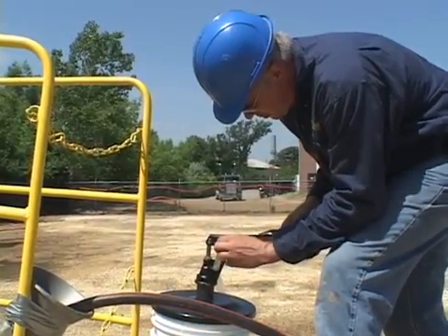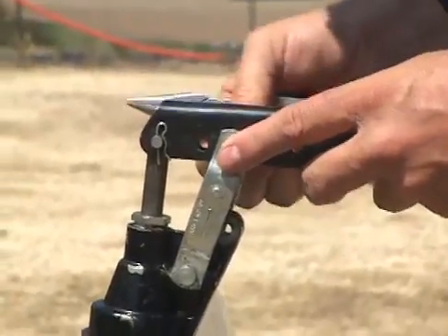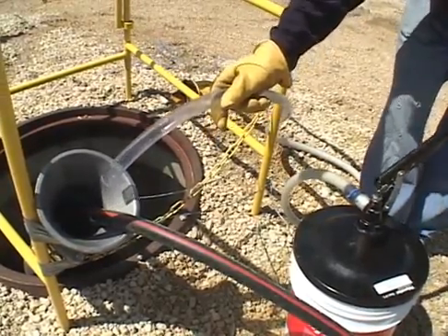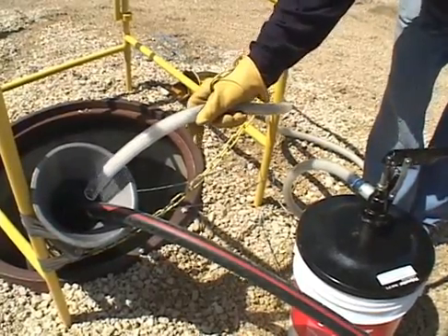This adjustment is quick and simple, as is shown here. The LP3 pump mounts directly onto a 5-gallon pail, and a 10-foot output hose is standard. Operate the pump with the up-and-down handle, and increase or decrease the rate of pumping to control the lubricant flow rate.